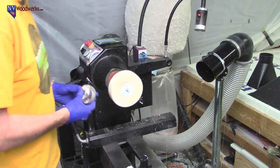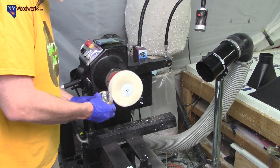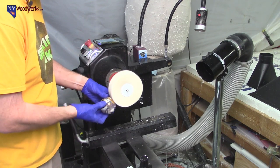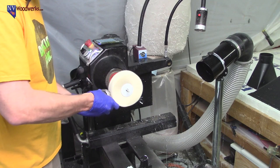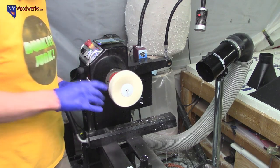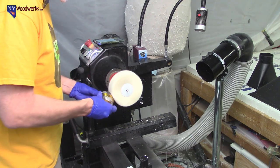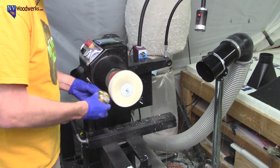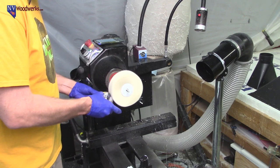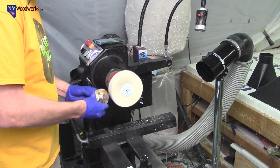And I gotta say, I'm very happy with it, but you really do need to get a nice, really soft wheel if you're going to be using a really soft, or fine grit, polish. You got to kind of match those up. I didn't get particularly amazing results trying to use the same exact type of wheel that I was using with the white diamond. So these things do kind of matter. The string buff is awesome. I got mine at McMaster-Carr, but Beall sells string buffs also. And I actually was going to buy one from them.